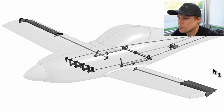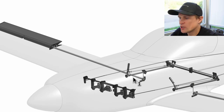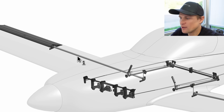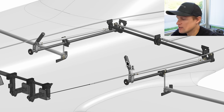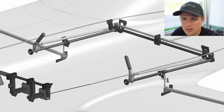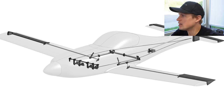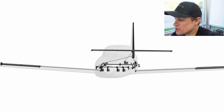The ailerons are a little bit more tricky. You can see the ailerons moving opposite relative to each other for roll control. Translating motion from the stick to the aileron involves torque tubes that run from the root of the aileron to the root of the wing. In the armrests, there's a torque tube that each stick is mounted to — as you move the sticks left and right, that spins the torque tube, which is connected via a link to the torque tube in the wing root. This kind of setup is more difficult to visualize in 2D, and that's where the Onshape motion simulation comes in really handy.